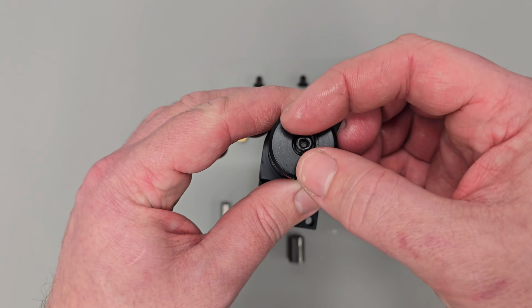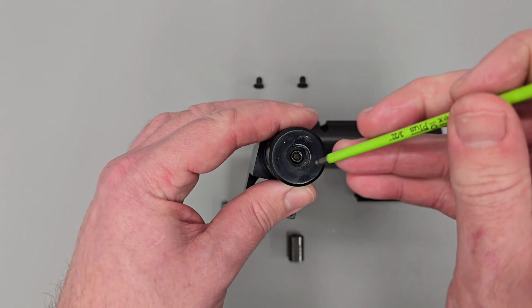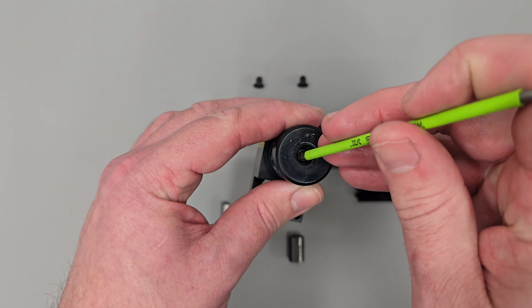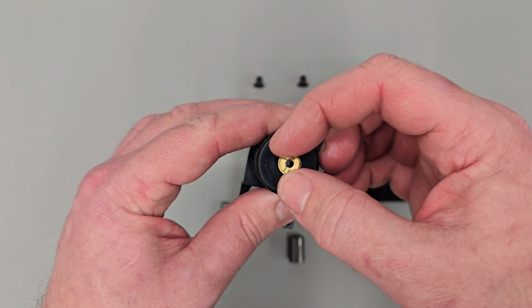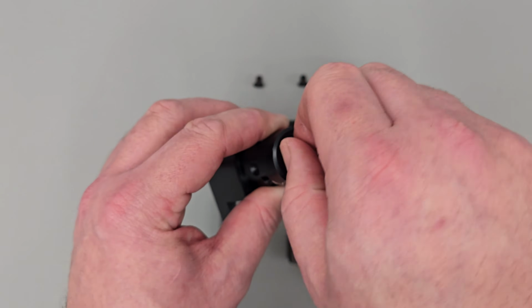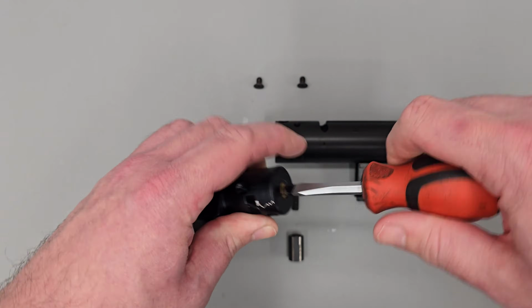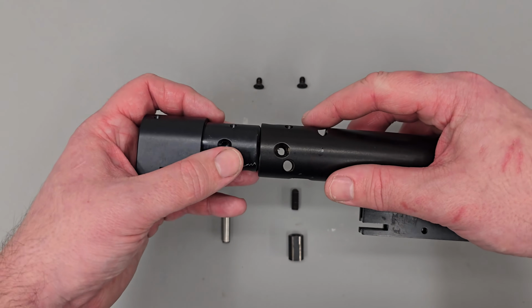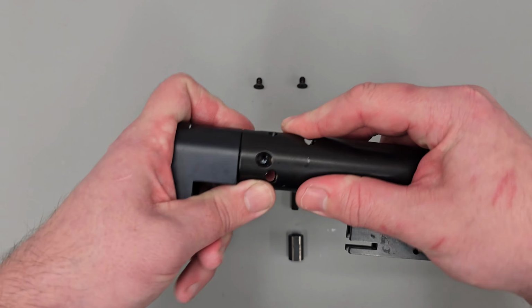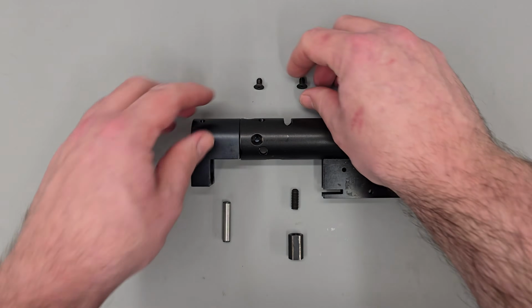With that said, we can drop the O-ring into the seat there and then get it seated with an Allen key or something similar. With that done, we can then take our cap, this piece here, and get that screwed in using a flat-bladed screwdriver. With that done, we can add the valve housing to the main block, nice and simply like so. Getting it pushed in all the way, then we can start adding the fasteners.